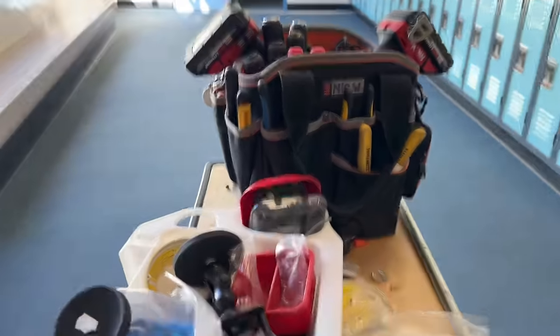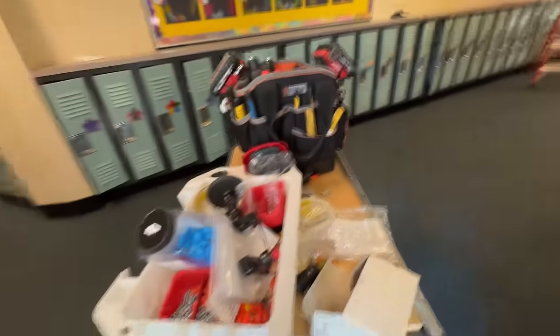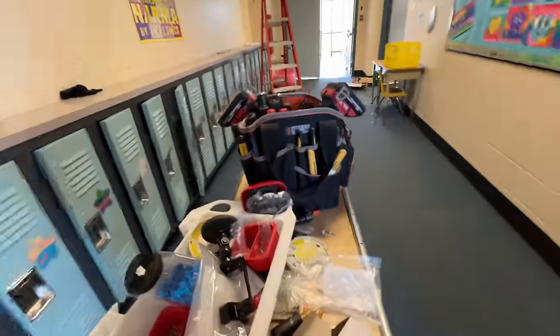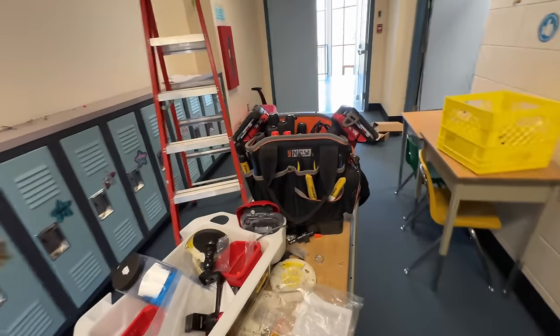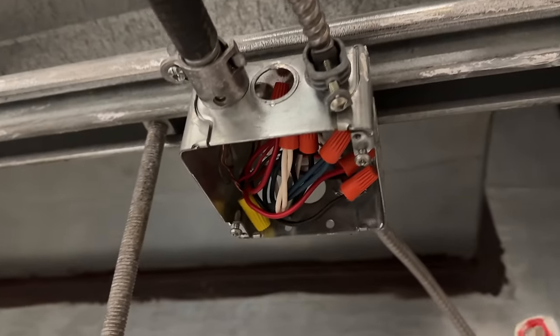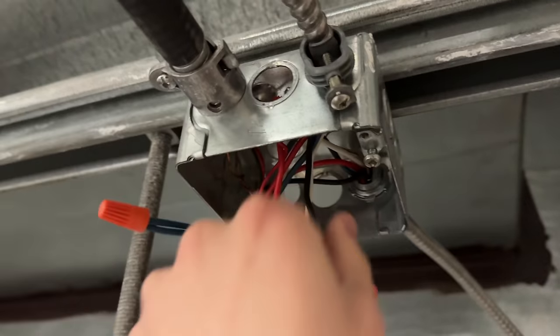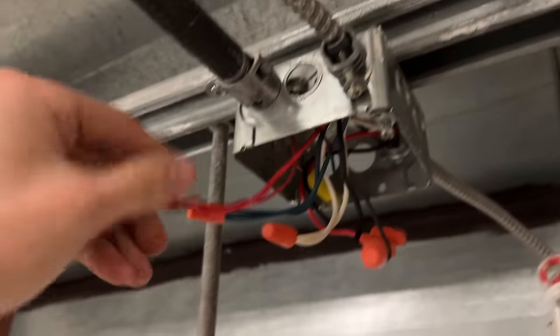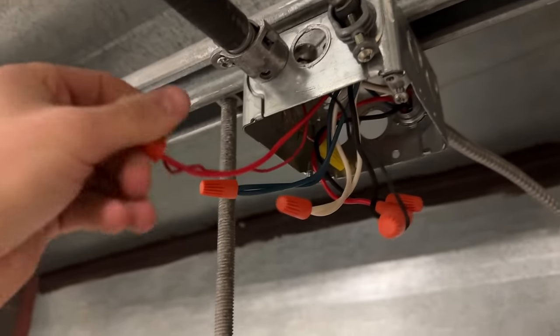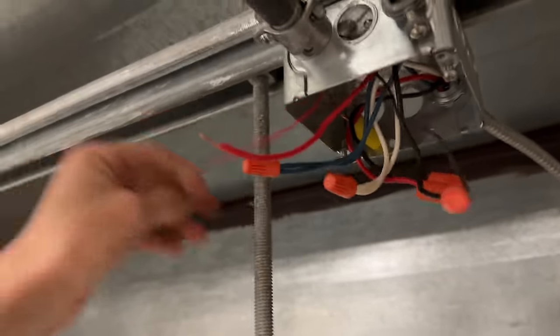Now, for some reason, the devices I put up in there, those duct smokes, are not responding, but they're not reverse polarity because it didn't take out the isolator, so I don't know if the address wasn't set properly. Doesn't make sense because the first one came to life when I plugged it in, but then the second one didn't. Now nothing's working. So I had 0 volts at my detector, and I'm going to take apart our incoming splice, which is this little 18 is what brings it in. See if I get voltage once I take it apart. Something tells me I'm not going to, so I can just take one side off of there.